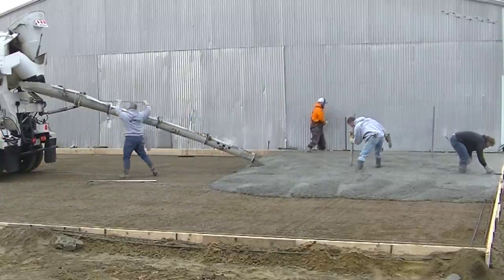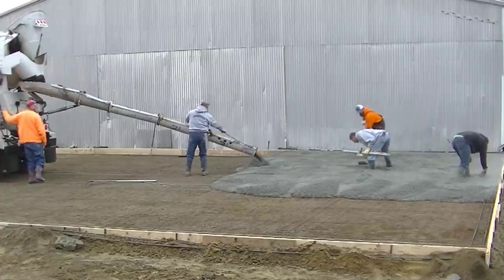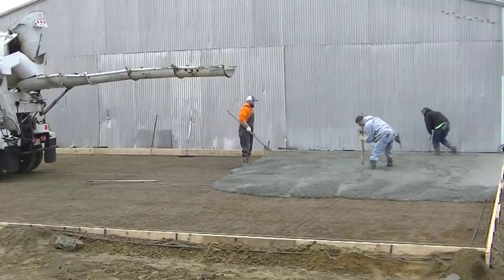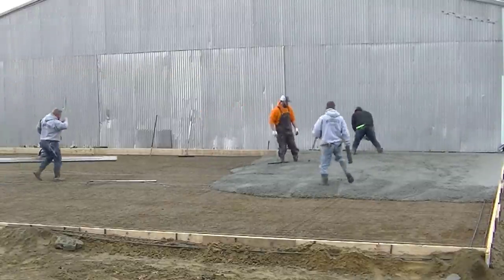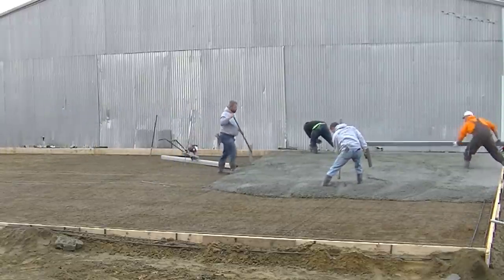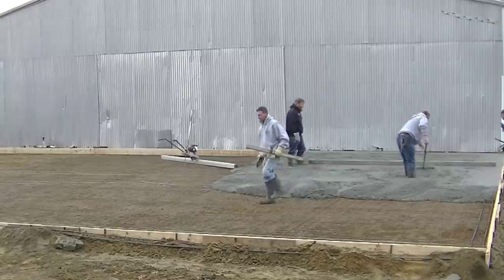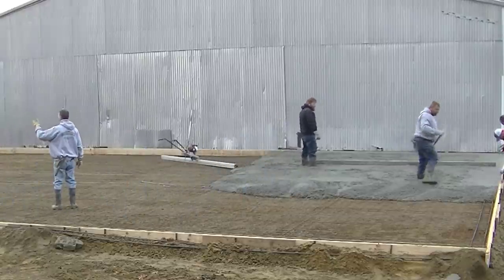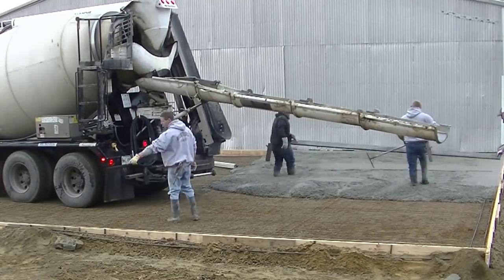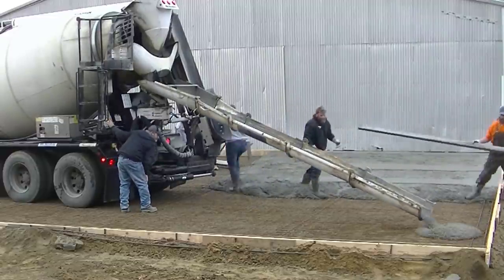There's the first truck — 10 yards dumped out. Now I'm going to make my wet pads so we can use those to screed from. The outside forms are set right to grade and this is just a flat slab, no slope at all. We're going to be using the Screed Demon power screed today from MBW. That's got a 12-foot board on it — you can get just about any size up to about 16 feet. We always strike our pads with a two-by-four magnesium screed first to ensure everything's perfectly level, then come down with the Screed Demon.